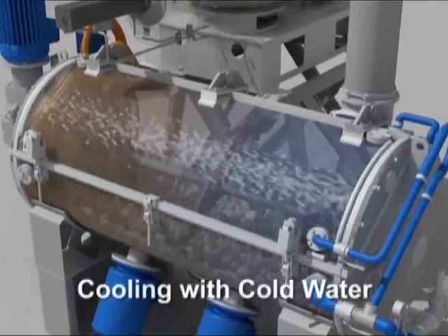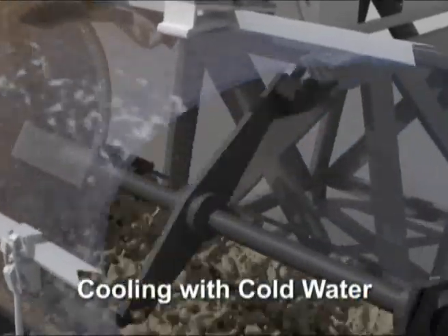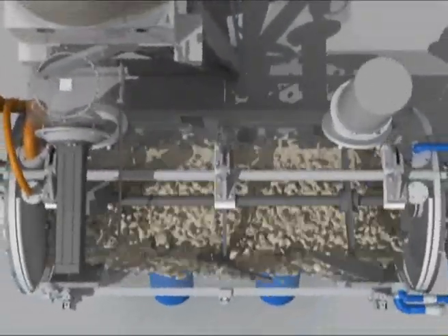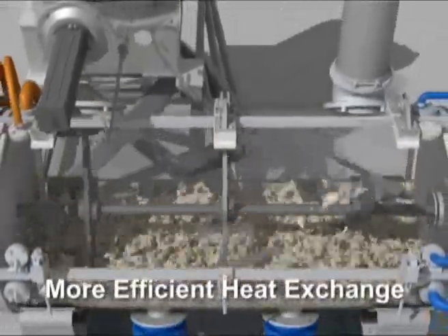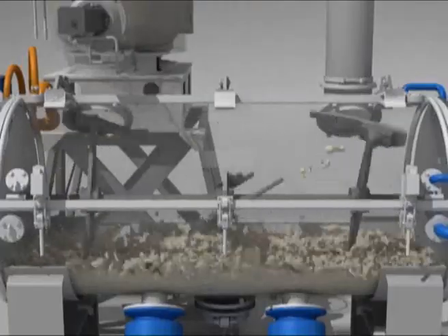The inside of the HEC is cooled with circulating cold water in a double jacket. In this way, all surfaces are cooled in a uniform manner, including the tank, the sides and the cover. The agitator inside the HEC has a geometrical design that keeps the material in contact with the cooled surfaces and gives a more efficient heat exchange.